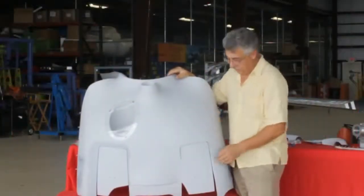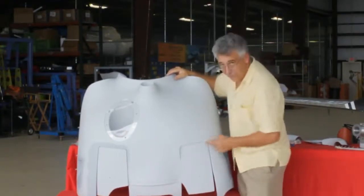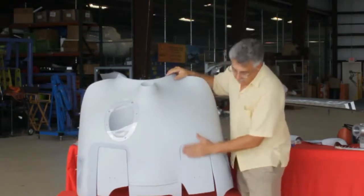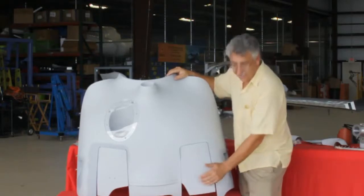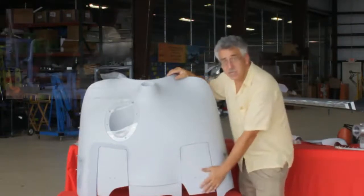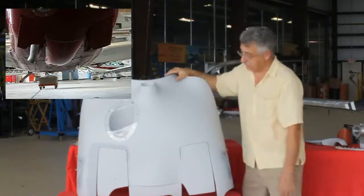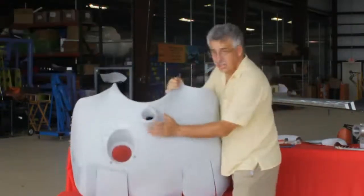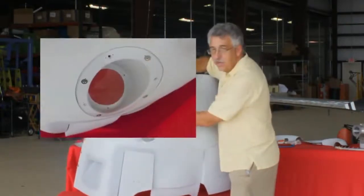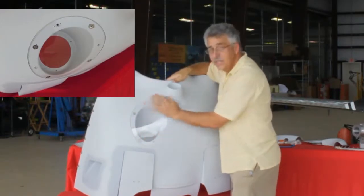Carbon fiber and fiberglass laminate — there are extra buildups inside the laminate. You know those places around the old cowl flaps where cowl flaps tended to crack? We've beefed that up a whole lot. Remember the old humps on your cowl flaps — those big draggy bulbous shapes? We eliminated that and went to a smooth cowl flap with nice low-drag flush exits. New ram air inlet — I'll show you more about the ram air in a minute. New lens for your landing light, nice screw count, preformed lens so it stays looking pretty.